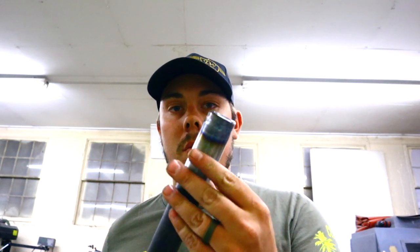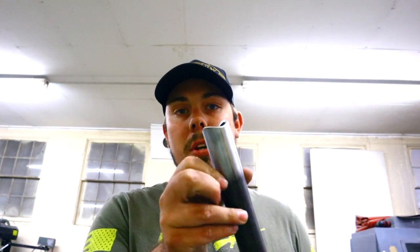Welcome back to DW Designs. Today we're going to continue part two of how to build the upper control arm as well as the tie rod ends. In the last video we went through the process of how to put the bungs on, how to make sure you measure it properly, and then tack the bungs on. In between the last video and this one, I already welded up the bungs to all of the parts we're going to be using, and I already have notched the tubing for the upper control arm as well.